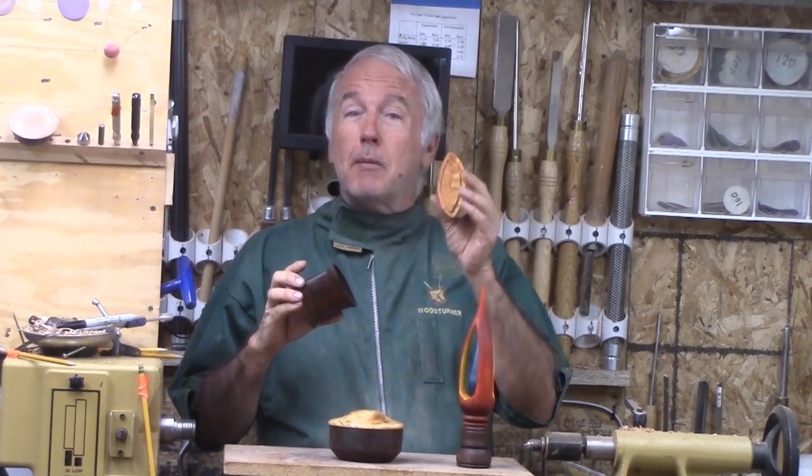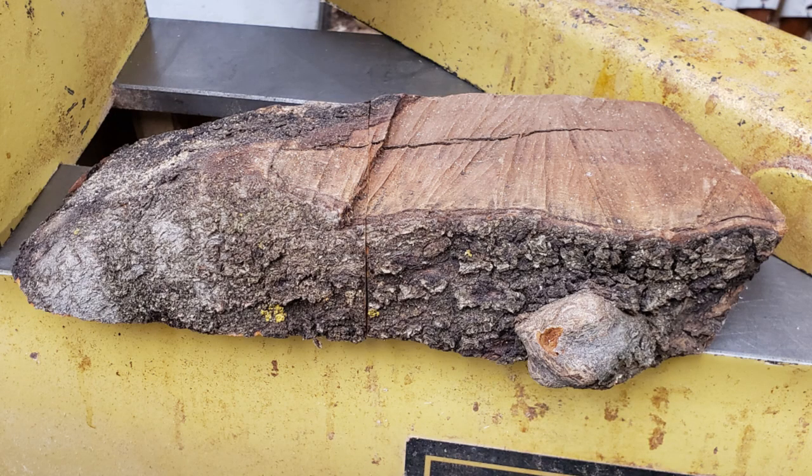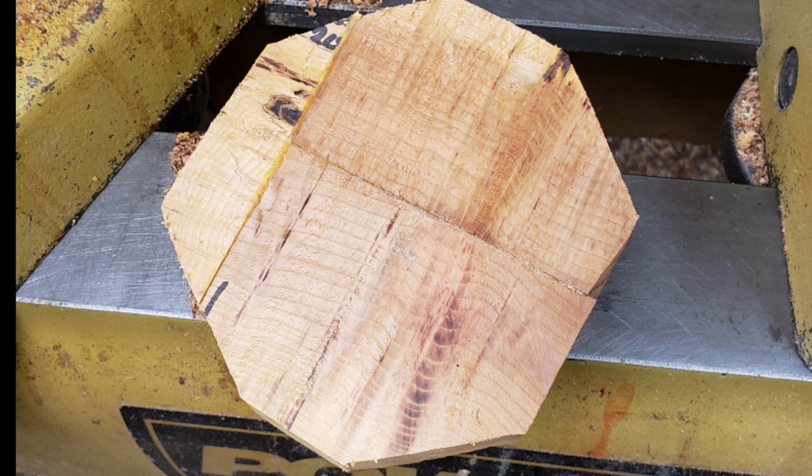For now, let's see if we can make a lid for this odd-shaped little box. The wood I need should be 5 inches in diameter. I rummaged through my supply of plum burl, but there are very few pieces of that size — those that are that size are saying they are for other projects. Finally I found one that did not object. However, it is just a little undersized for width and oversized for length. I cut the block in half and glued the halves together, but then they were a bit short. I cut off a little more of the width and glued it across. This is a bad joint with grain direction changes. However, I will be cutting this lid in half — so instead of a true half, I plan to cut a pizza slice. More on that later.